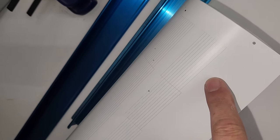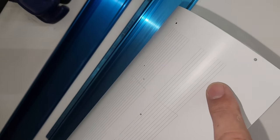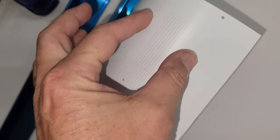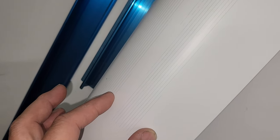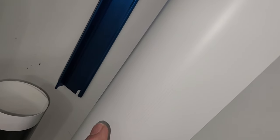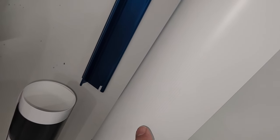So this is the nozzle check off of the Muto, the printer that we're just looking at. And this is the nozzle check that I'm talking about. So this is what you want to look for. This is the self-generated nozzle check that comes off of the printer. This is pre-installed, and you do not need software to diagnose or see whether this is working. This is built directly into the firmware. This is part of the general maintenance when you do your printer cleaning.